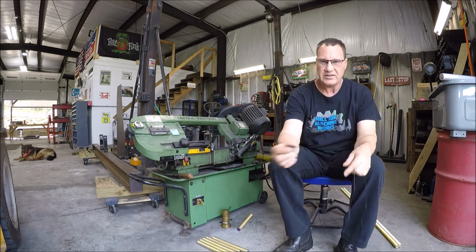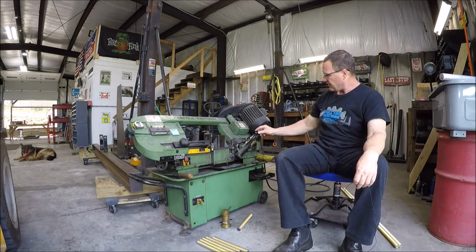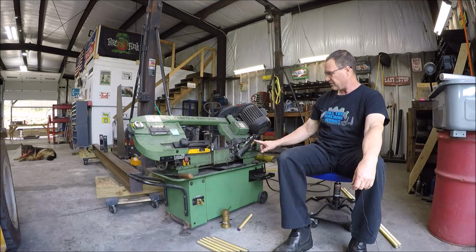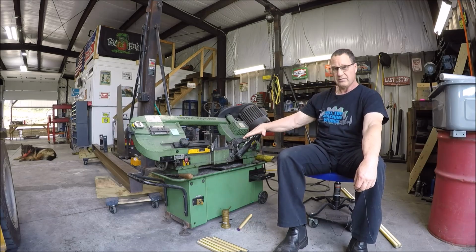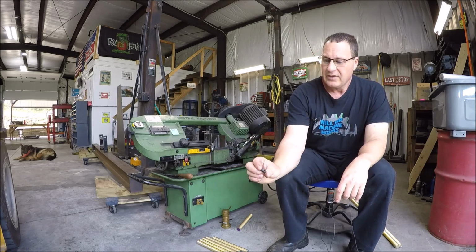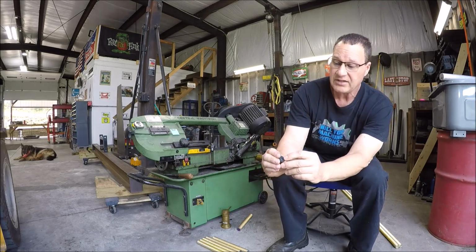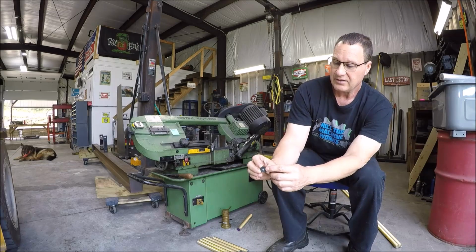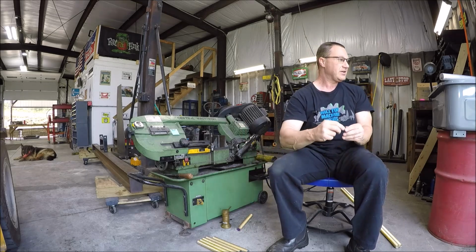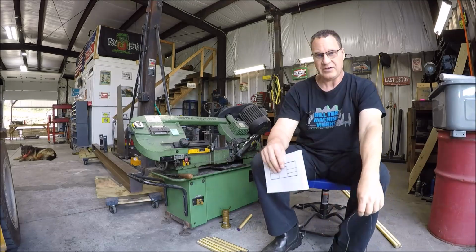let me show you, it's this cheesy little thumb wheel that they've got on the end of this rod here to adjust your pressure for your hydraulic cylinder, to be able to control the downfeed. I mean, it's just chintzy. They usually break. This one hadn't broke yet, but it's got a crack in it. I know you guys can't see it from where they put the set screw in. So they don't last.